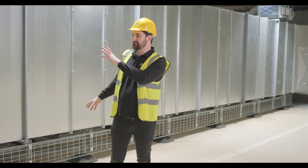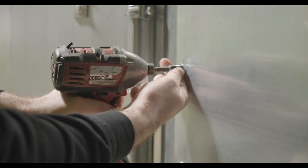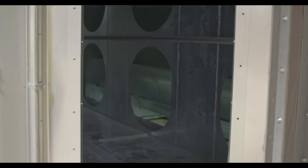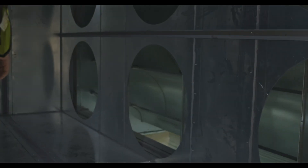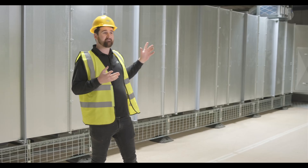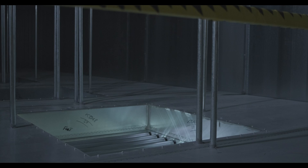Within this duct, as we'll show you on some B-roll, we've got six fans at the other end. These six fans allow us an N+1 - it's actually slightly better than N+1; we could lose two fans and run on just the four. We've got turning vanes after the fans, which are very important because they ensure we keep laminar airflow as the air wraps around that tight bend back towards the data hall, where it passes through our chilling coils.